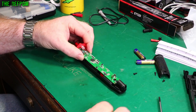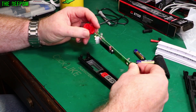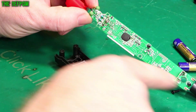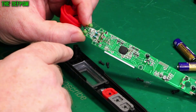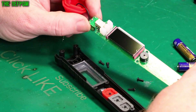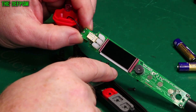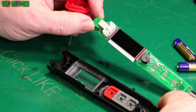Taking the board out — five screws. The input protection is up at the top end: a couple of PTCs and a couple of MOV resistors. There's a torch LED there. It has the same issue as the ST100 with the backlight dropping behind the display — it's just zebra-strip rubbers holding it on, so be careful not to knock it. There's a little relay in there you could hear clicking.